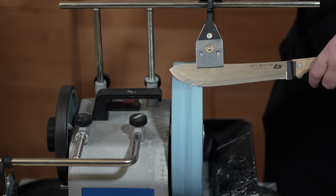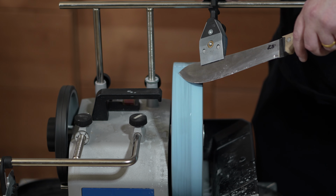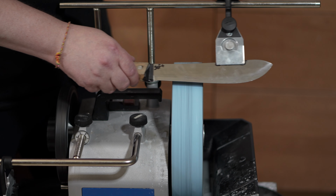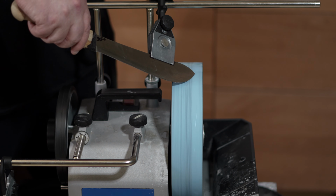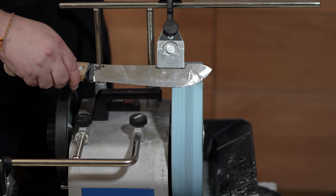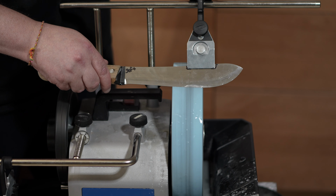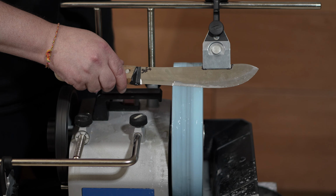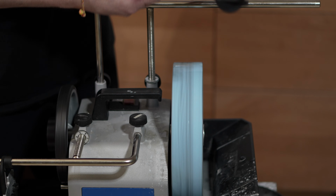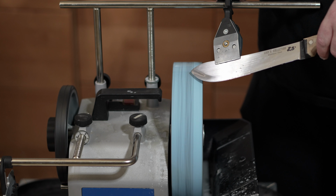And the shears I sharpened for John, my other customer, those turned out really good. My first run though, I got a little nervous because I put them back together and they were cutting great except for in one spot. And I got my loupe out and I was looking at that spot and I couldn't see any issues. So I was just at a loss, but then I come to find out that these were 40-year-old shears. They had been bent up a little bit.